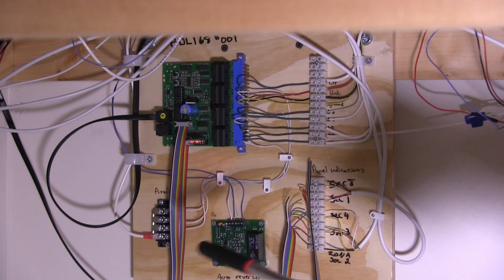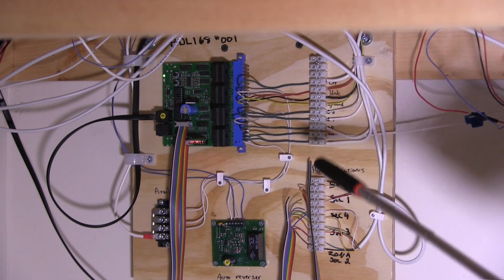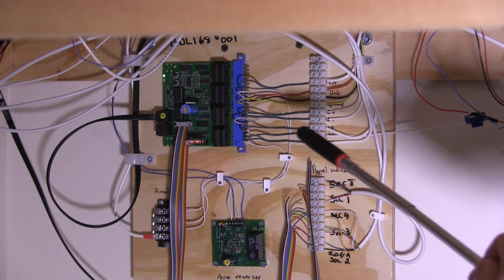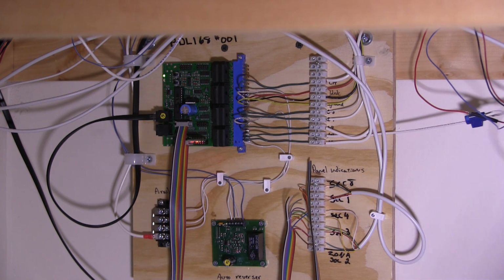So that's why I'm not bringing it directly off of the command station. The power comes in from the booster, and then it's broken out, and that's what the white wires are going into the edge connectors. That's power, the A rail in. And then the A rail comes back out of the card, and that's what the green wires are, and then goes out to the various rails on the different sections. You don't bring the B rail into the card.